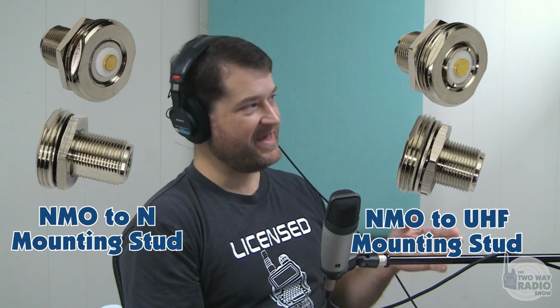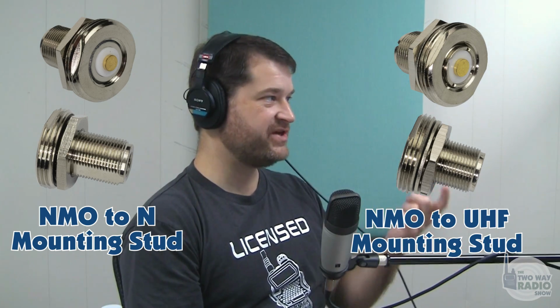All right, so we have the mounts. We have some studs, NMO to UHF and NMO to N. The studs are just tiny, short, 2-inch long adapters, basically, with a nut that lets you screw them into a bracket of some type that you would have a hole for, sized for a hole mount. It's NMO on one side, and then we have two of them, a UHF and an N.